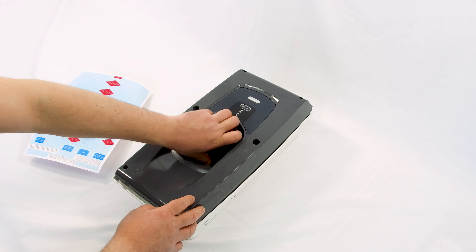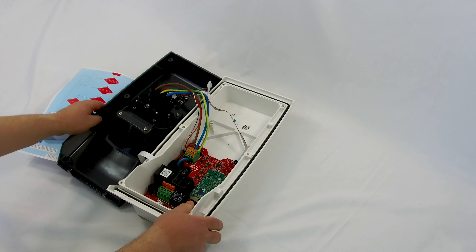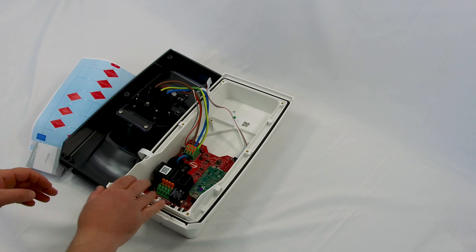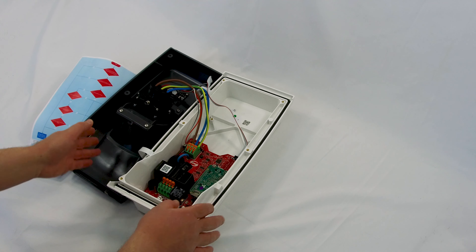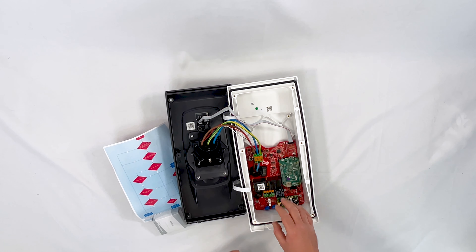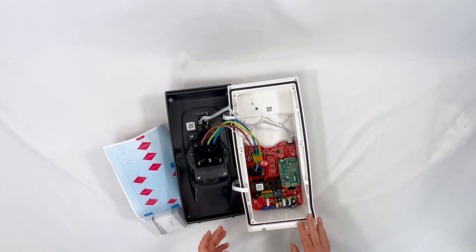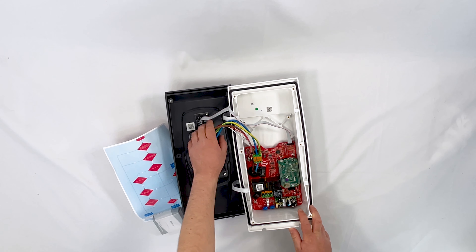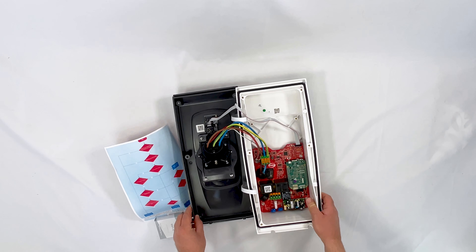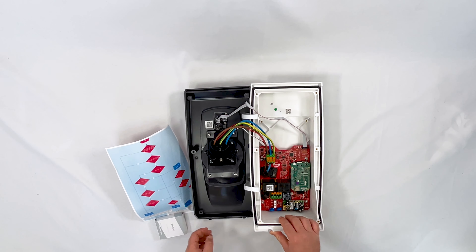The front part of the unit is the un-tethered version where you connect to the vehicle. The unit separates into two halves - the front half is the vehicle-facing part and the rear half is where all the electrical connections come in. One of the things I really prefer is when there's a rear plate like this for connecting all the services to, rather than on the front face plate. A previous charger I reviewed had the tethered cable connected while you were wiring the services, making it cumbersome - this one actually has two solutions for that, which I thought was quite clever.